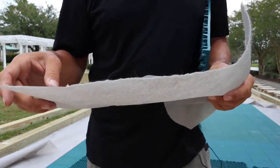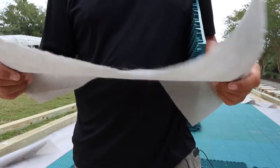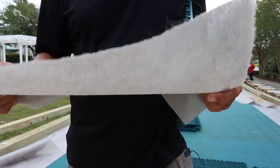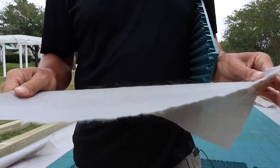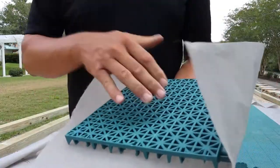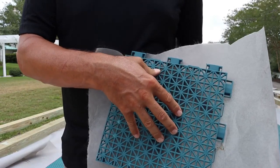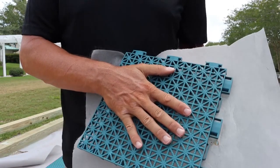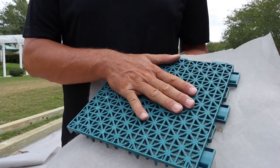So in this job, we've installed the weed fabric, and before we placed the tile over it, we pulled our yard staples and secured one side of the project and left one side loose, and we've pulled this fabric tight and then laid the drain tile over. That prevents it from pushing through into the base, causing your base material to push up in here, which would create low spots or potential areas for some puddling until the water was to transfer through.